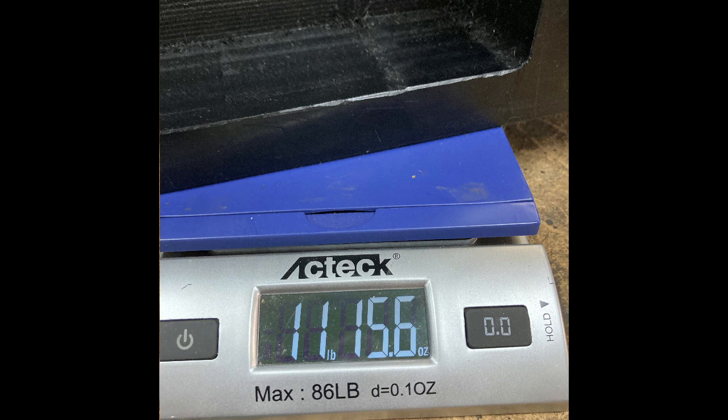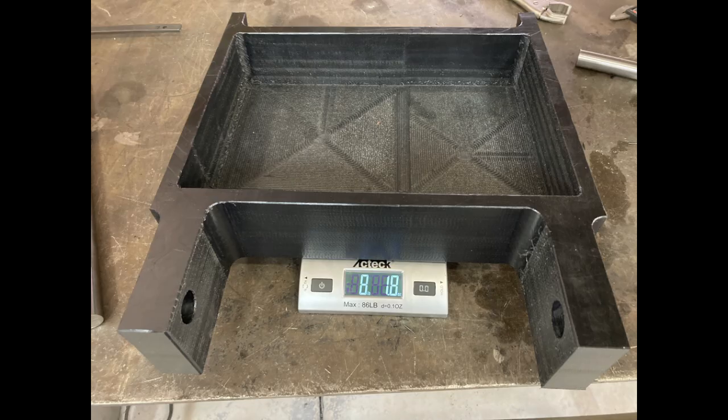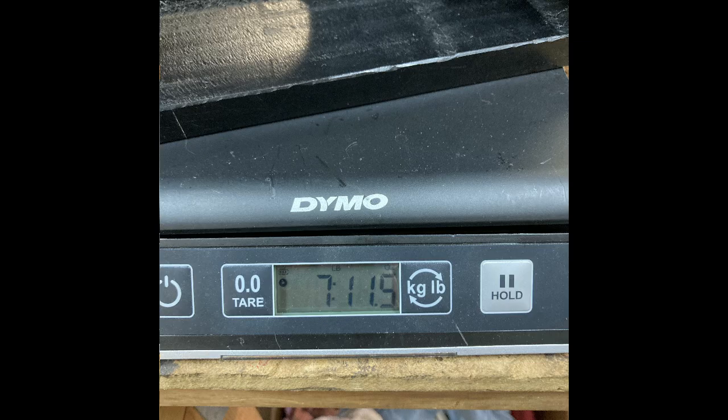But 12 pounds is going to be too heavy, so I went ahead and thinned the sections that support the weapon and did some thinning down the sides. At this point we ended up just over 8 pounds, which may be good, so we have to start weighing things to see how close we are. We were still too heavy for the 30-pound category, so I decided to further thin the sides down — now we're at 7 pounds 11 ounces.